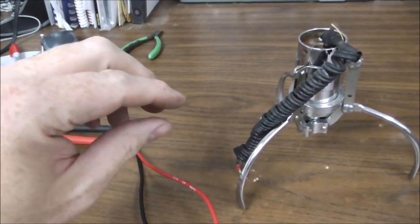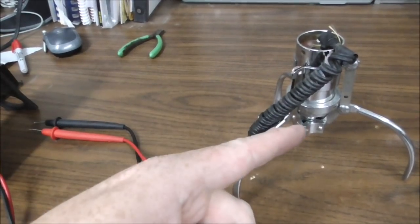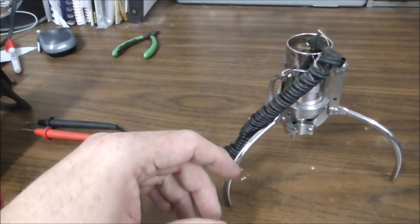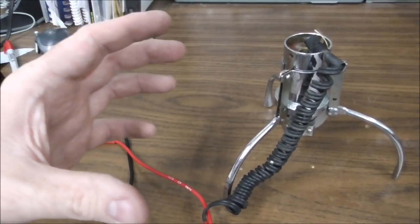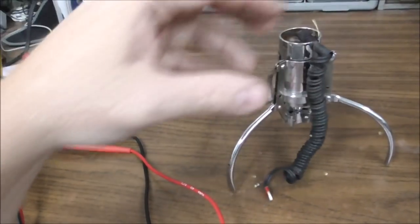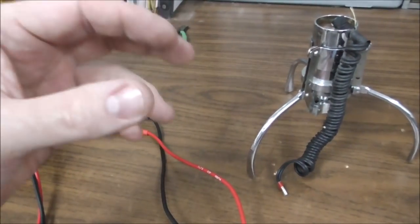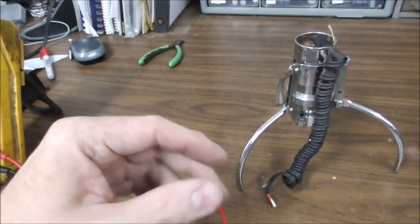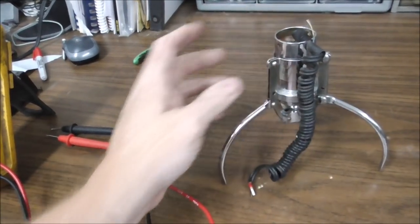So if that's not it, it's often the pot on the board that adjusts the strength of the claw. Yeah, that's right. They can make it weaker or stronger. Thank you for your quarter. You had to do that, though. If it was something really big, it needed to be weaker because the thing would just clamp right over it. And if it was something really small, it needed to be even weaker because it made it too easy to grab. That would be able to adjust that. So that potentiometer could be the problem, or a broken wire, like always, could be the problem.